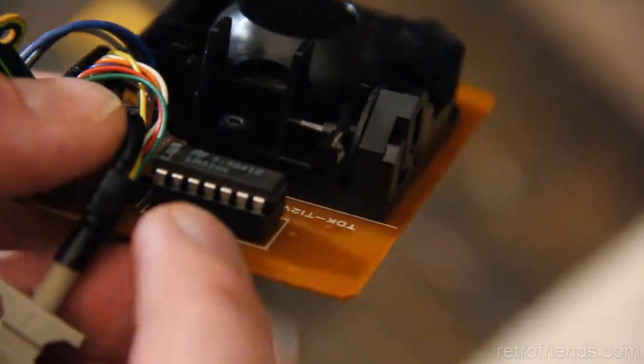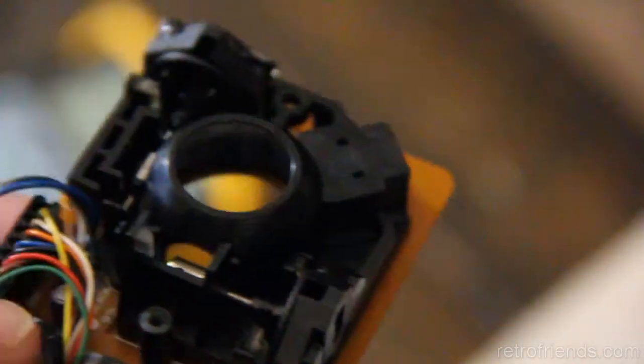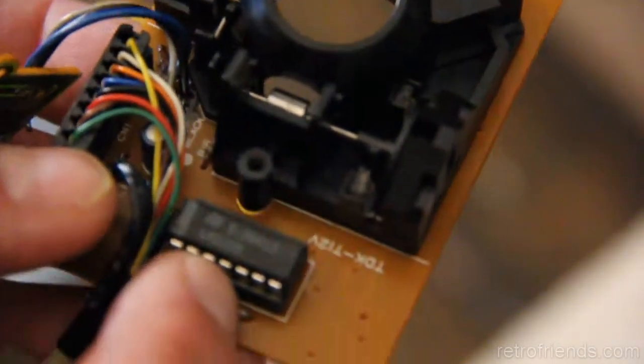So anyway, this chip here, I socketed it thinking that it was some sort of problem with the chip, but of course that whole time it was actually just a mechanical issue. But this is a 14-pin quad comparator, and there's actually several part numbers. I actually had a couple of compatible chips, and the one that is in the newer mouse has a different model number. This is actually the one from a newer mouse I have here, and it's a 10339. As long, I believe, as the model number ends in 339, an LM339, a 10339, I believe it's going to be the same.